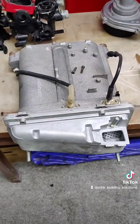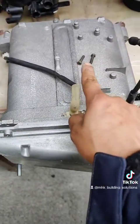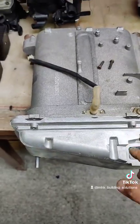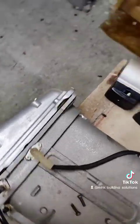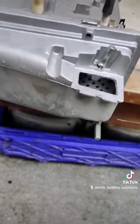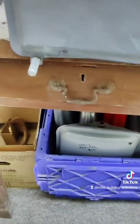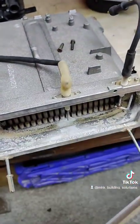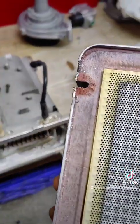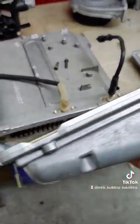Let's have a look at this burner now. I've removed these two screws. Obviously the boiler is turned this way normally when it's on the wall, so these are the two front screws that we've removed already. The back screws you don't need to remove completely — you can do if you want to, but it's just a matter of slackening them slightly. As you can see, the burner has these two slots that it just slides into, so it just comes out.